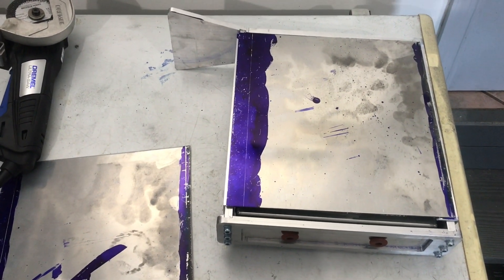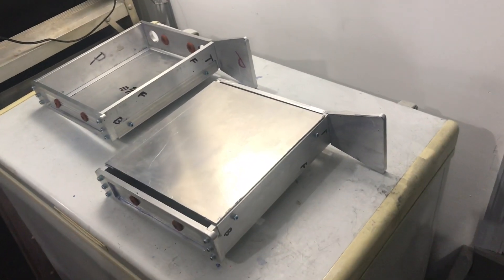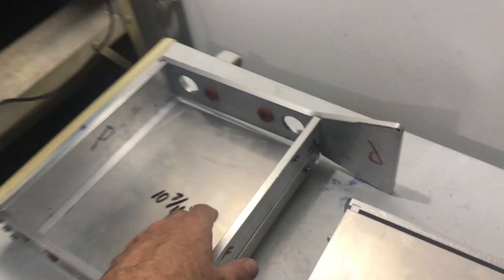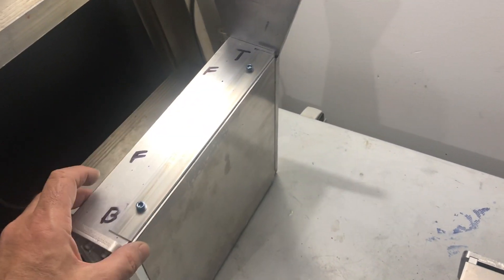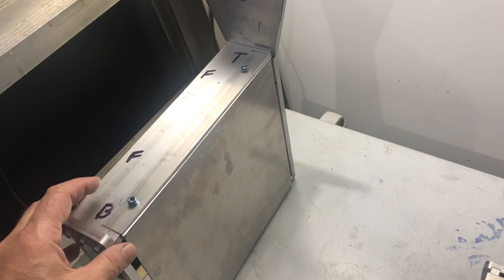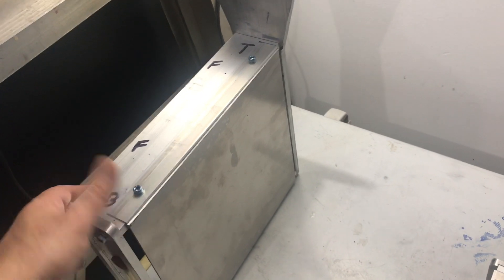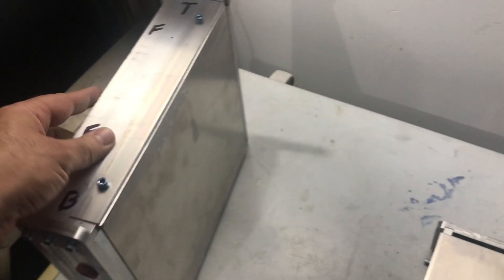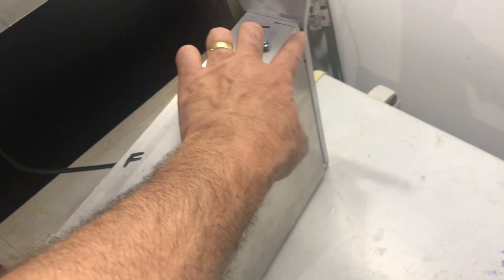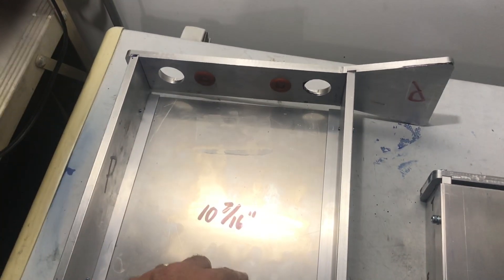The intercooler brackets are ready to go to the welder. I drilled two holes on each side, really just marking the orientation to everything - just to be careful I didn't ruin any of the pieces. It's easy to get confused. But this design mounts that edge really flush, which is what I wanted. The welder will do the TIG welding along the top, which will look good, and probably do a couple of spot welds in the back. Once I get it done I'll cut the circle out for the fan.